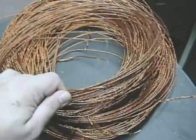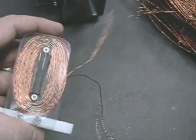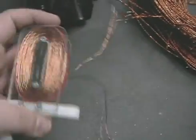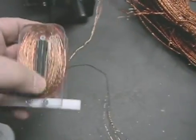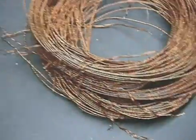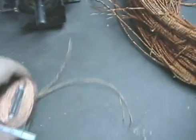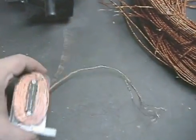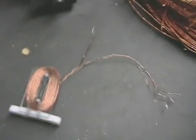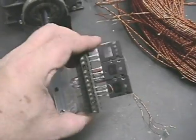These coils are number 18 wire — they're a little bigger. The drawback is they'll work but you can't put more than two amps into the pulse motor before they start to get warm, and I want to be able to dump a significant amount of amperage through them. So in my case I'm going to use these larger ones — they're going to be interchangeable, so I could basically take them off and put these on if I wanted to.